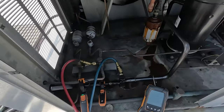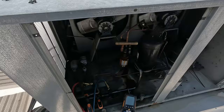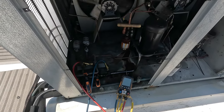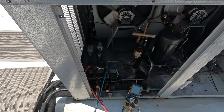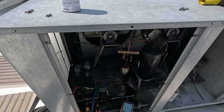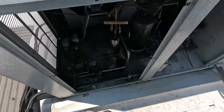We're looking around and we do have some bubbles. This does not have a receiver though — the manual says don't overcharge it. Make sure your superheat is following along, get your presets, check your superheat, because we're running plenty of superheat coming back to the compressor. We're at 37 degrees superheat, which is kind of surprising it's that high. The controller is in the 7-area, fluctuating a little. I'm not going to add anything — it's already dropped some temperature. I think we were down 18 degrees already from 45 as I was taking my gauges off. Just went into a defrost cycle — you can see it.